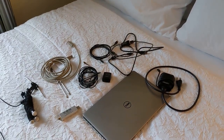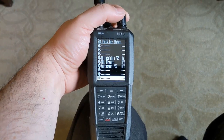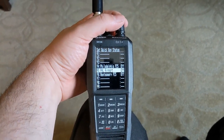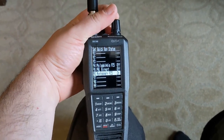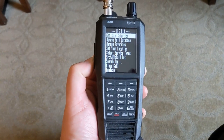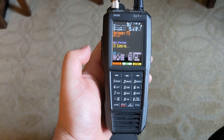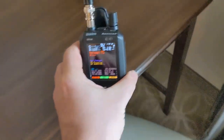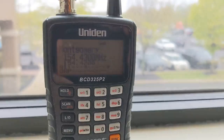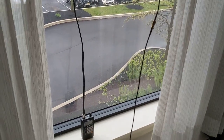So let's start setting up and see what everything looks like. Before leaving on the trip I set up a favorites list for my Pennsylvania trip. For flying into Philly I had the Philadelphia P25 system on, though it's no longer in range where I am right now — I'm at the far side of Montgomery County. With that selected we should be able to start receiving some signals. Police here are encrypted, but fire and EMS we should be able to pick up according to the RadioReference database. And you can already see the Uniden picking up some VHF fire stuff — there were some tone-outs there.